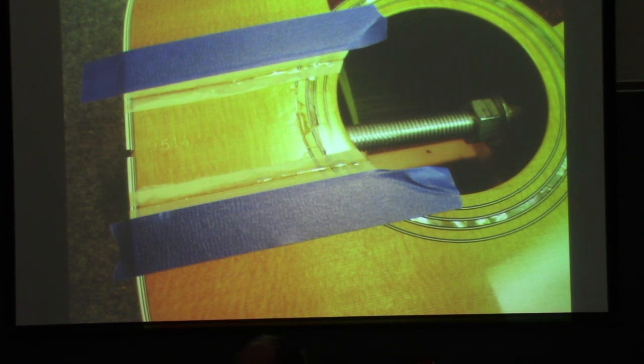And the reason being is because if you've got two pieces of wood that have been glued and that glue joint failed, well, there's adhesive on those surfaces. And if you just add more Titebond or whatever, you're just ripping off the owner. So I found that epoxy works great for an old failed glue joint.